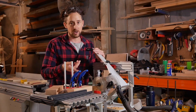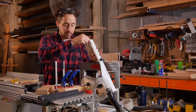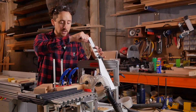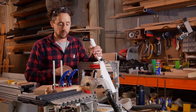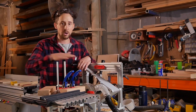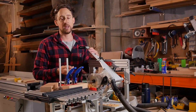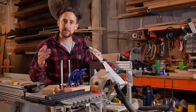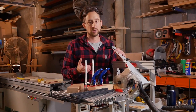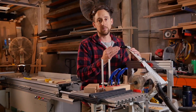I'm going to start in the middle since I know that's a good place to start. This cutting procedure involves climb cutting, which is unlike almost any other routing application — you're running the router bit in the direction it wants to go over the timber. Don't try to sink the bit right into the meat of the timber and do a full pass. I like to do lots of shallow passes on the top, then a few on the bottom, until most of the material is removed, and then run around the actual template. Don't force the bit through a whole chunk of timber as that can introduce inaccuracies.